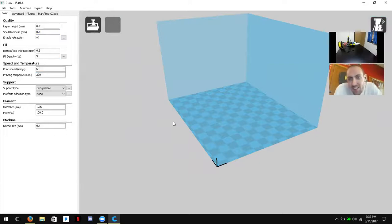Click OK, then OK again on the machine settings screen and it should change the area of your build plate. That's all the settings we need to change in Cura to set up our printer — the initial setup for slicing and G-code. Now we're going to go through the process of actually setting up a file within Cura.